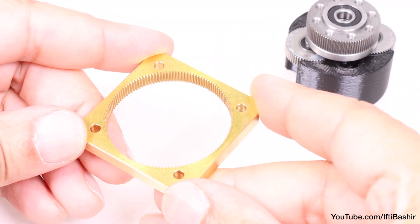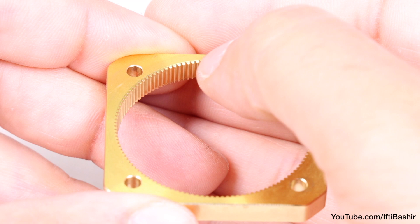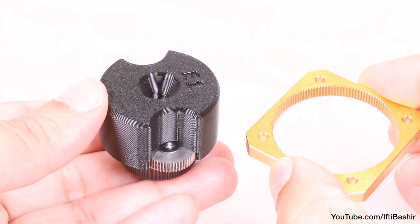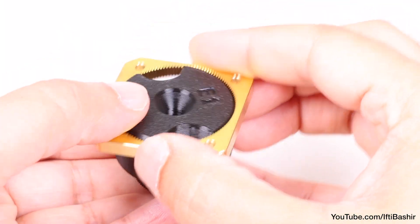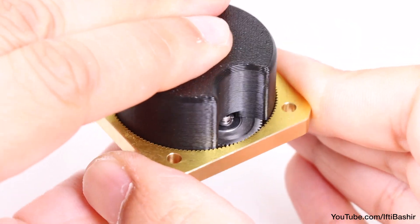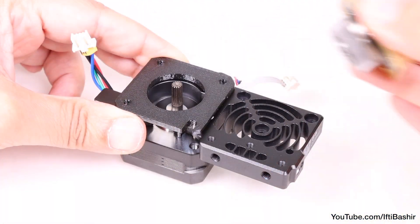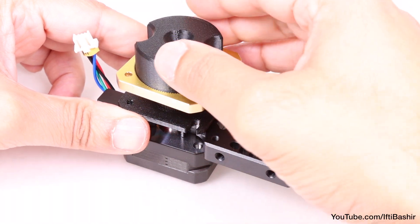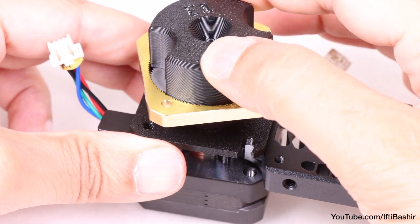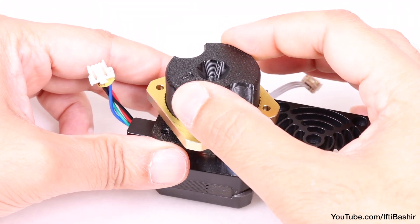Once in place, the next step is to slide the gear ring over the adapter and down into place. Looking at the teeth in this ring, notice how one side is completely straight while the opposite side is very slightly chamfered. This is important, since the chamfered side must face downwards as you lower it into position from the top. Don't be concerned if the ring doesn't feel like it's turning smoothly just yet — it will do once the plastic tool has been removed. Now holding the entire structure in place, lower onto the motor shaft so that the shaft enters the hole in the central gear. Do not force the unit down at all — we're letting gravity do all the work here. Slowly turn the entire assembly until it drops itself down into place.